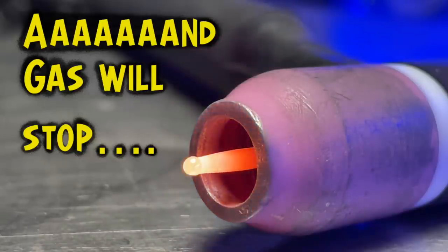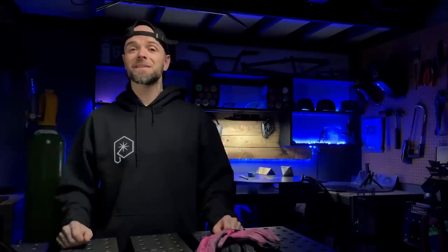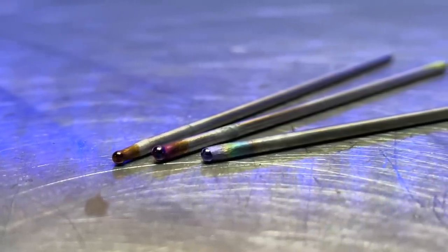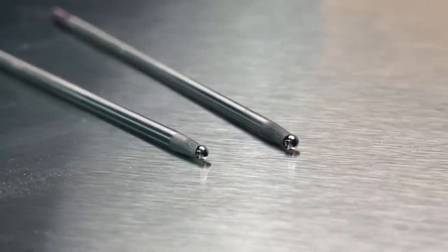Once again, your timer on the machine has to be set for a long enough duration to properly shield this electrode — an extra second or two after your tungsten is finished glowing red hot. When done properly, we should always see this tungsten looking shiny. Sometimes you may see a little bit of color to it; that's a light form of oxide that has formed. However, when it's just a little bit of color, it's not a huge deal. But ideally, we want things to be super shiny.